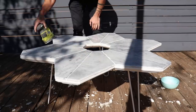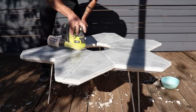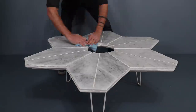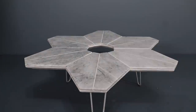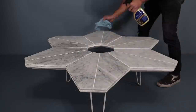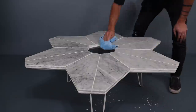This tile had been sitting out in a scrap pile for some time and got a little bit nicked and scraped, so I used my orbital sander with 220 grit paper to sand down any scratches so that everything would be nice and smooth. This does mean that I'll have to reseal the surface of the marble to prevent staining, so I wiped it all down, cleaned it with some stone countertop cleaner, and then applied some seal.